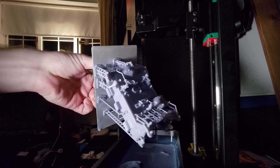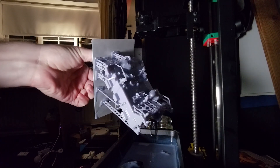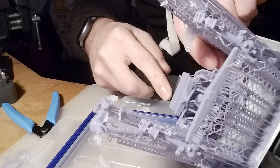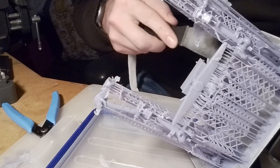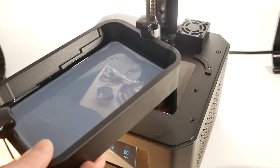Once your print is ready, just put the USB stick in and you're good to go. A couple of hours later you'll be watching your print slowly emerging from the vat. Then the messy part starts — you need to time your print correctly, because leaving it unattended will cause the resin to cure, making removal much harder. It's wise to time your print so you have around an hour to spare when it's done, so you can save resin from the vat — I use a 50/50 mix of used and new resin.